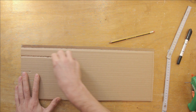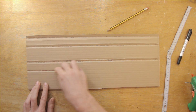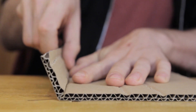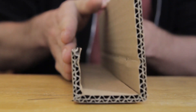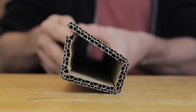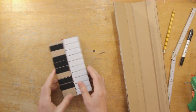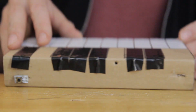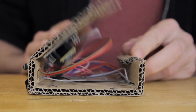I'll expand all these marks by using a finger to break one side of the cardboard along the length of the corrugated pattern. That will weaken the cardboard along these nice straight lines, allowing me to make straight, clean bends. Take care when bending to only bend along the marks so that you get nice square corners. One section is a bit too wide but I'll take care of that in a minute. First let me show you what I'm trying to make by looking at my previous capacitive keyboard build.